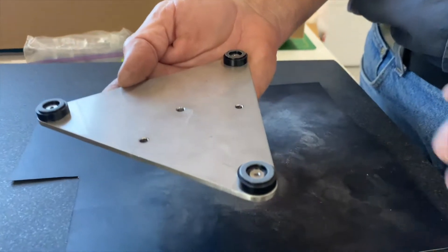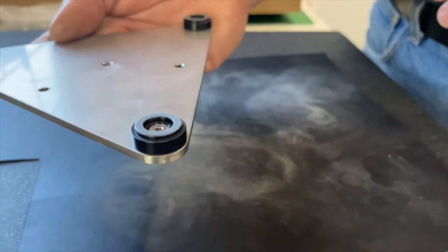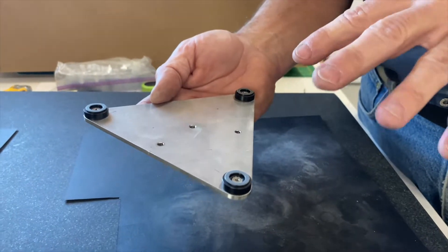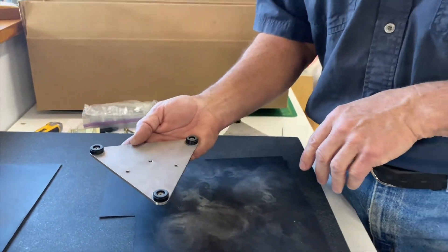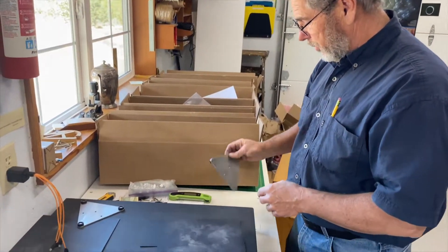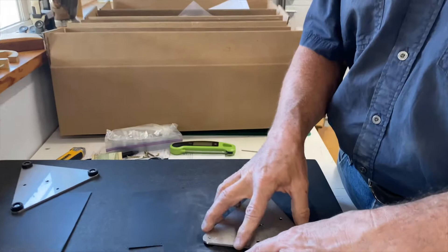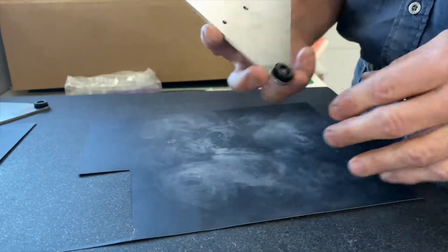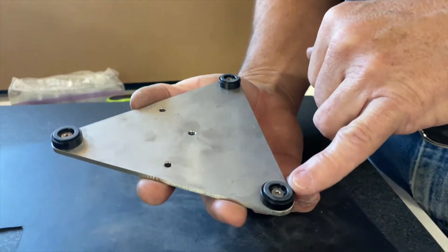There — now that one has a nice flat planar surface. Undoubtedly we now have a little more ability to support the mirror on a larger surface area. We're going to do another one and show you a stronger example of incomplete flatness — there you go, that's much easier to see.